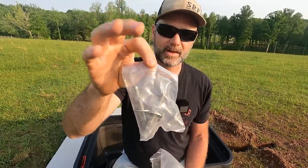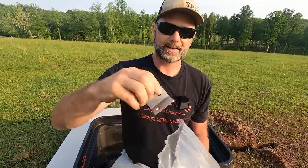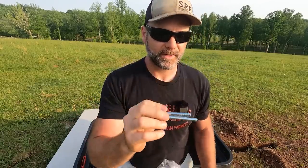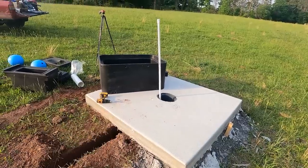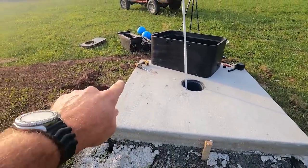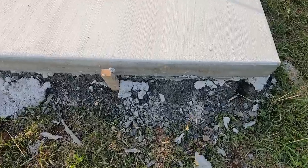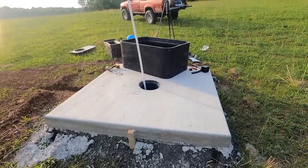These anchor bolts go into the concrete pad. We have a few hose clamps, stainless steel brackets that hold the Mirafount in place, and training bolts — I'll show how those work once we get water in this thing. The Mirafount goes on a concrete pad; they recommend at least 16 inches on either side of the waterer. I made these pads six by six. If I had to do it differently, I might make it eight by six just for a little more room on either side. The cows are going to come up and step right up here and drink. I did build six of these all at the same time, and I have three more on the other side of the pasture to install — this will be the only one I show on camera.